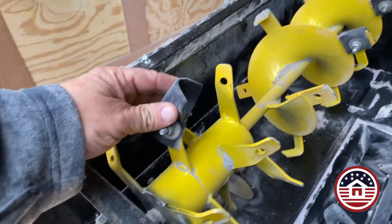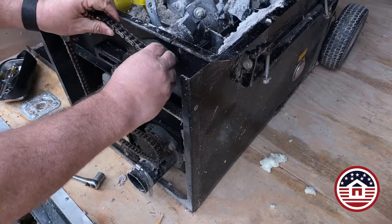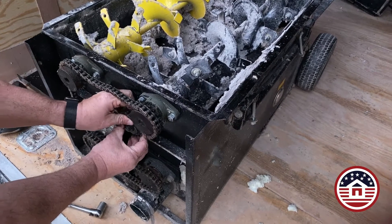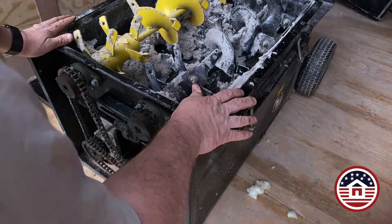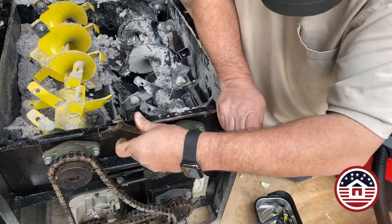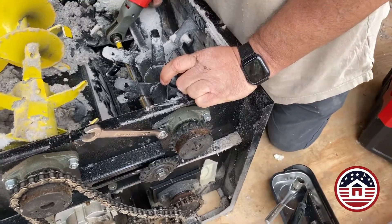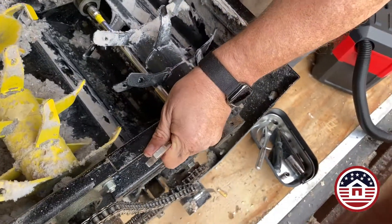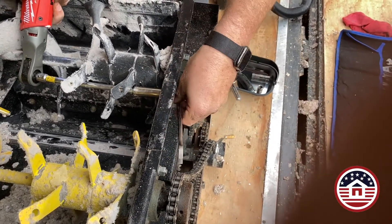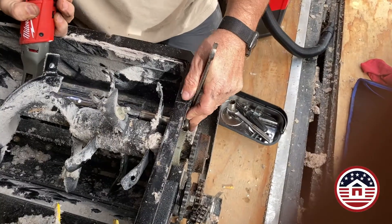These little wipers are what we call auger wipers. You will have 10 of them in your machine when you purchase it, and they are replaceable. Now we're going to undo the chain in the front so that we can remove one auger — specifically the one on the right-hand side — which will require a 9/16 inch wrench. I like to use an extension and get in there with the 9/16 on the other side so you can bypass the little augers above the airlock. You're going to release four of these bolts, two on each side.